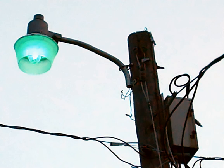Next, the voltage between the two main electrodes will ionize the mercury gas. An arc initiates between the two main electrodes and the lamp will then radiate mainly in the ultraviolet, violet and blue emission lines. Continued vaporization of the liquid mercury increases the arc tube pressure to between 2 and 18 bars, depending on lamp size. The increase in pressure results in further brightening of the lamp. The entire warm-up process takes roughly 4 to 7 minutes. Some bulbs include a thermal switch which shorts the starting electrode to the adjacent main electrode, extinguishing the starting arc once the main arc strikes.